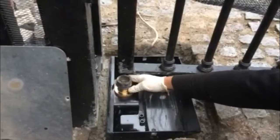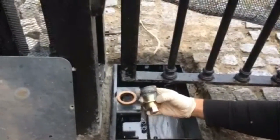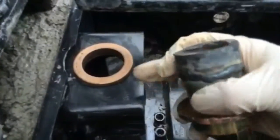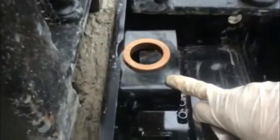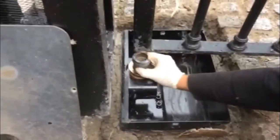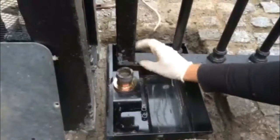In this case, this is the left side motor, and on the spline there is a little notch, as you can see here. That notch needs to be lined up with the notch on the box itself. That's the position of the spline that's going to be welded to the gate.